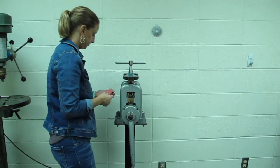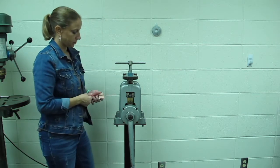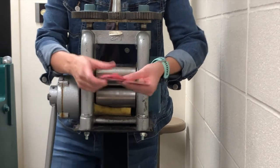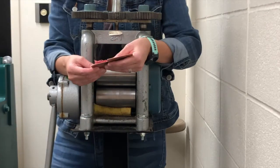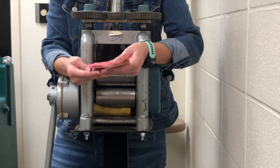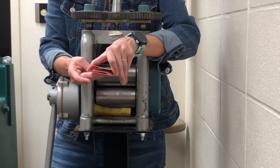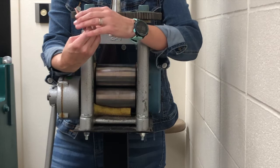Here we are at the rolling mill. We are going to use this roller for all of our texturing because this one is for sheet — the other rolling mill handles both sheet and wire. I have my two pieces of material and then I have what I'm going to use for the pattern — I just took a shop towel and cut it down. The important thing about the sandwich is that you want none of the cotton hanging out. The whole reason we had two pieces of metal is to sandwich the material in between so that the texture material does not hit the rollers.